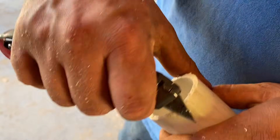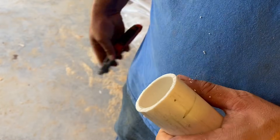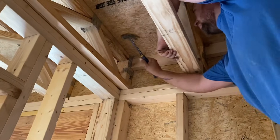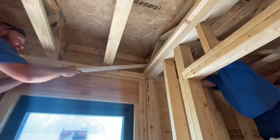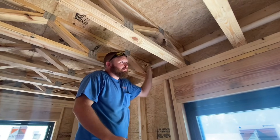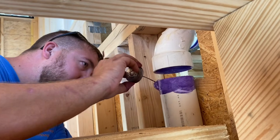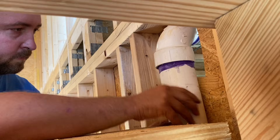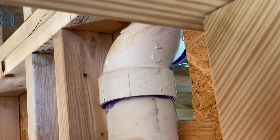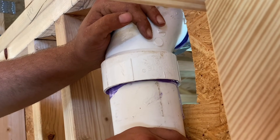After cutting a PVC pipe, you have to do a process called deburring. This will get these little spurs off the cut and keep them from catching stuff later when the pipes are in use. So here's the problem: installing a super long piece of rigid pipe through trusses like this is not really possible. So the plumbers have to fit pieces as long as they can and then join those shorter pieces to make one long run, and they have to do this everywhere in the house where they can't get a longer piece in. Making a joint in this PVC pipe is a two-step process. First the pipe is primed with this purple-looking primer, and then PVC cement is added to each side. Then the plumber twists the pipe in and holds it — this is a very important step of the process evidently.